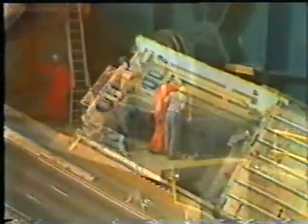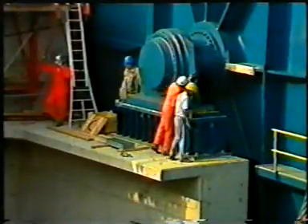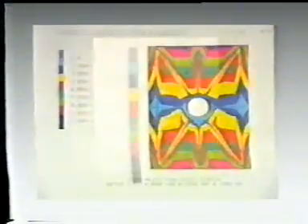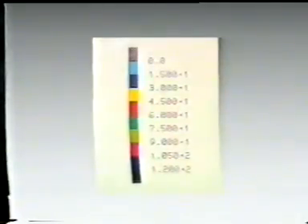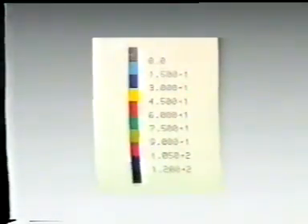To ensure enough room for the main girder of the bascule bridge to rotate over an angle of about 80 degrees, the bearings are placed on brackets in the pit. While rotating, the stress distribution in the bridge changes continuously. The stress distribution is calculated for dead load, for rotation from the closed moveable position up to the opened position. The colours indicate the equivalent stresses within a certain interval: violet — a high stress in the interval between 105 and 120; light blue — a low stress between 0 and 15 newtons per square millimetre.